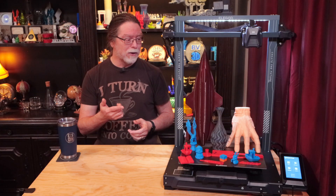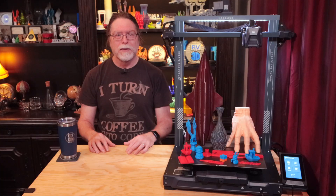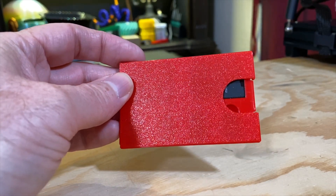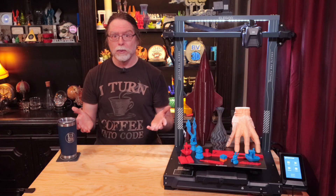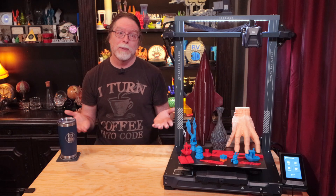Let's get into the things that I like and don't like about the printer, starting with the things I like. For as large as it is, it's easy to put together, and Elegoo has a really good assembly video on the memory card. I like the LED strip across the top. The mesh bed leveling works really well — I leveled it once after I got the printer set up and haven't had to do it since, and I've been printing a lot of things on it. The textured PEI flex plate leaves a nice texture on the model where it touches the bed, so on models where the top surface prints first, those can look almost like a professionally made part. The direct drive extruder is a big plus. The fans aren't super loud, and the one that cools the heat sink on the cold side of the hot end only runs when the hot end is over 50 degrees Celsius. I really like the way it looks — the aluminum extrusions are a nice blue-gray color, and the silkscreen branding looks nice.